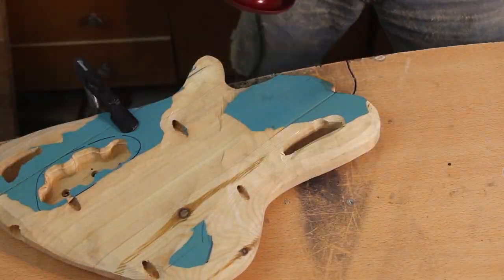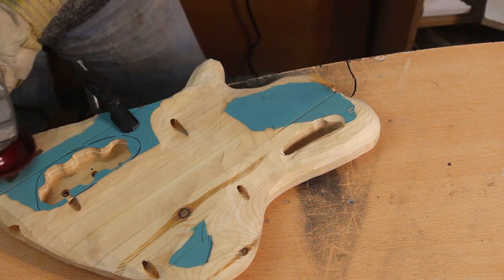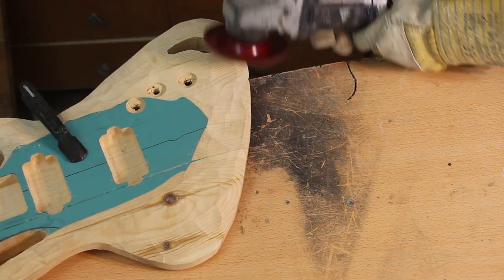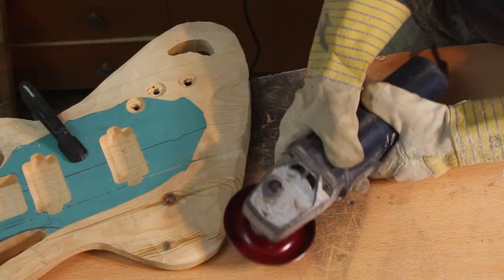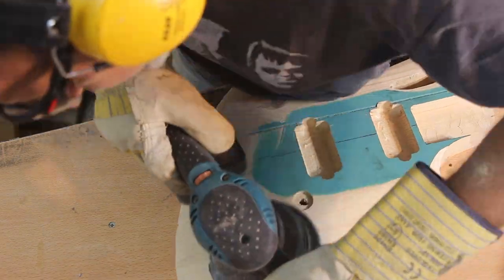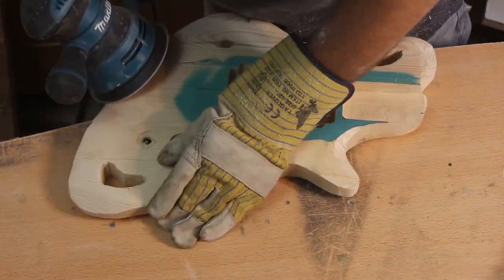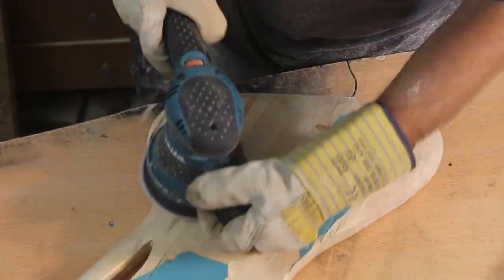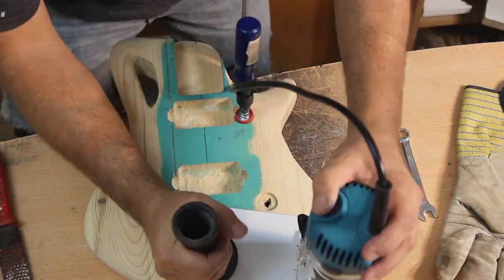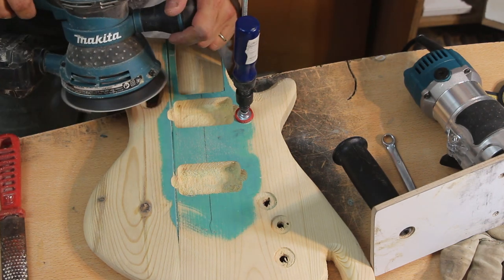Aside from the classic elbow rest and belly contour, my main goal is to get the overall shape to be a little convex and as thin as possible wherever possible. The only flat area will be the bridge and pickup area, and I'll leave some thickness at the bottom curve for comfort when playing seated. After the rough disc work I move to rough sanding — 60-grit paper helps remove all the rasp scratches and dents to get a more even surface. The monkey grip will also require some extra attention and maybe some routing with a round-over bit. I'm still not sure if I want to give it more definition for the fingers like the Ibanez ones.